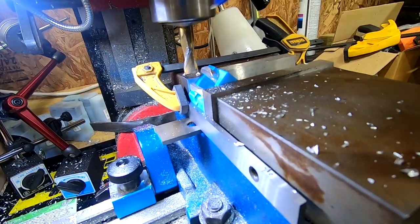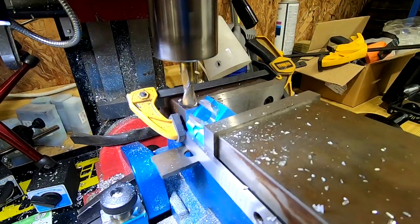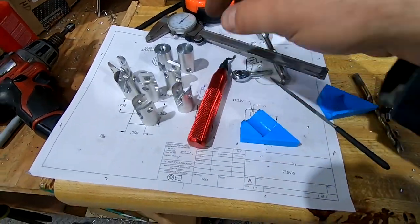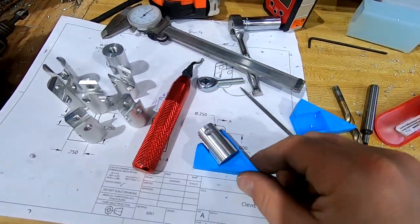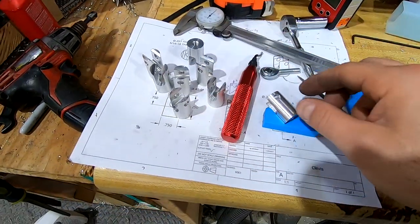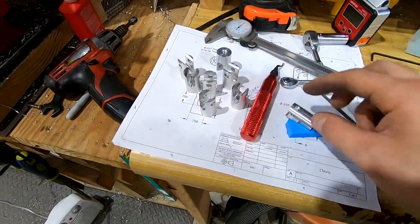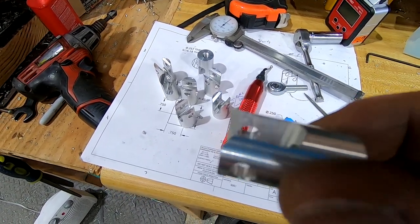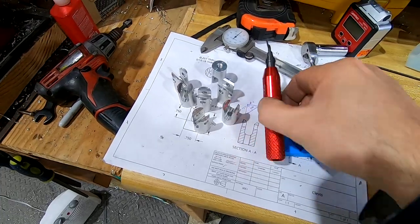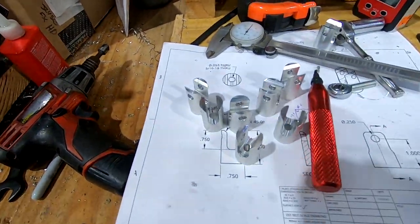We're ready to make our pass — I already touched off on this edge and moved the mill inboard. We'll do a spring pass backwards as well. There you go — a perfect 45 degree chamfer, finish looks really good. With this repeatable 3D printed jig setup I can just take it out, rotate it 180 degrees, and we're ready to make the next cut. Both chamfers done — finish looks good. The jig worked out really impressively and I ran through all of them very quickly.